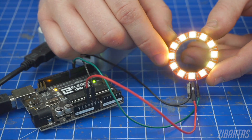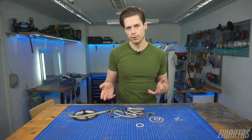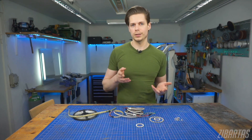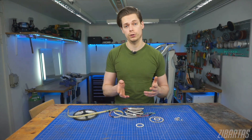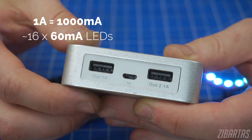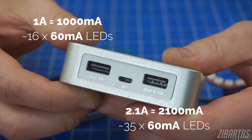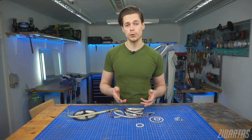Generally, with LEDs like this, it's just so much easier to use USB power banks, mostly because both are 5 volts. You could technically use disposable batteries to power them, though honestly I don't know why you would. Also, bear in mind that USB power banks and batteries in general have current limits. 1A ports can power 1000 milliampere worth of LEDs, and bigger 2.1 ampere capable power banks can drive 2100 milliampere worth of LEDs at once, safely. However, if you want to power many hundreds of LEDs, you won't be able to use a simple power bank — I'll discuss this in an upcoming video about powering large numbers of LEDs.